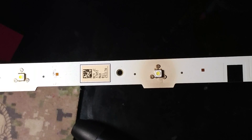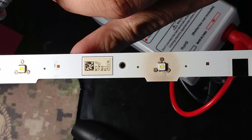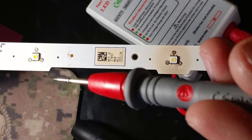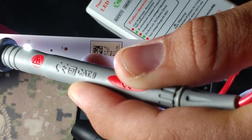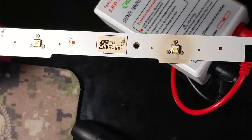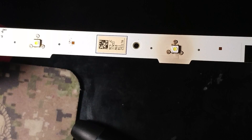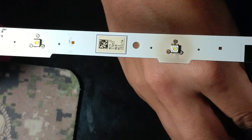Let's test it from the actual source. Let me try one more time — I want to make sure I have a good connection. The voltage reads 24.6 — that seems good. We have one, two, three... nine LEDs; nine times 3 volts gives you close to 27, with some loss landing at 24.6. I do sell these on eBay and they work well — pretty good quality and I haven't had any issues.